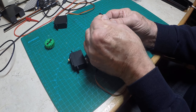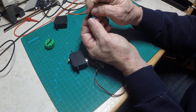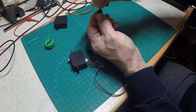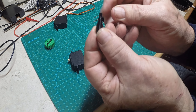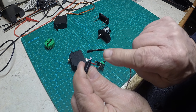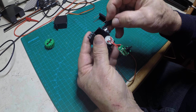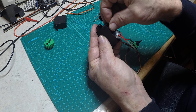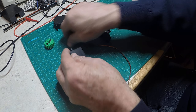I've tried printing these a number of different times and found that if I print it without the flats I get a really nice straight print with good steps on it. Then take a file and file it down to get the two-millimeter width, and keep trying it until you can push it down into the slot in the right direction. When you get it to fit in there, you're all set.